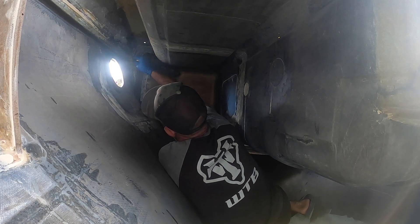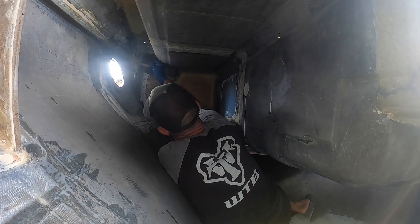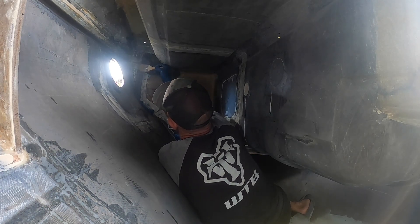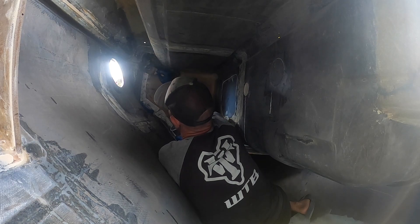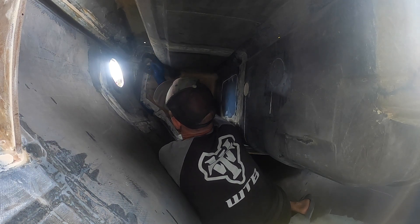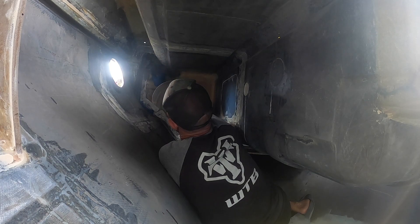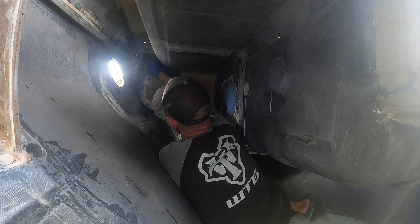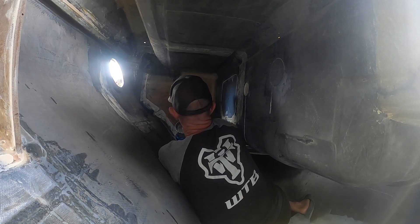You can see all the work exposed. For the hour prior to doing this tape - craft film - I was making the fillets. So I went down all these joints and put the epoxy-filled fillet in to make the cove, which makes corners much stronger when you put the rounded cove in.